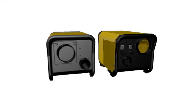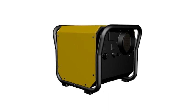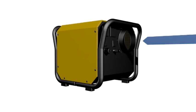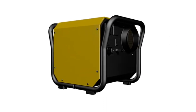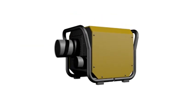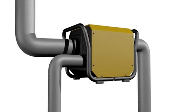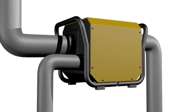The DH2500 has a single motor but is ideal for keeping stores dry or flood drying. The DH3500 can also be used in three hole mode as a simpler but more powerful dryer. Damp air comes in and clean filtered air comes out through filters, with a standard 125mm hole for process air inlet and clean dry air outlet. The exhaust water via nano-mist is expelled through an 80mm hole.